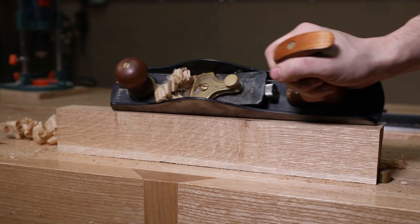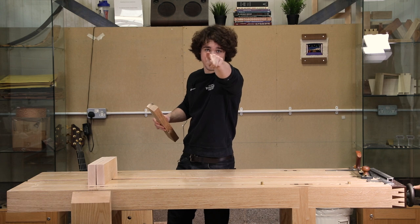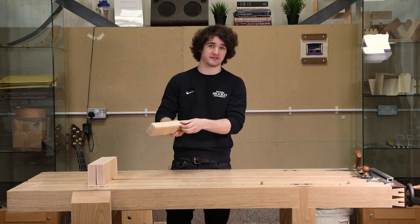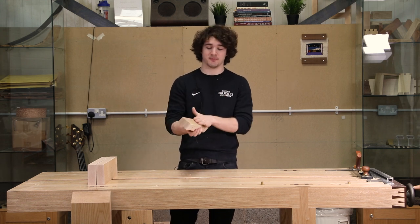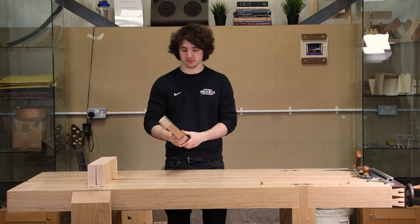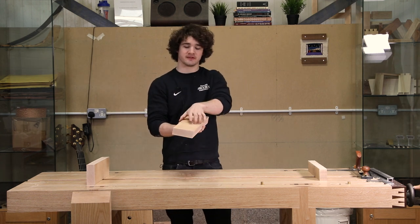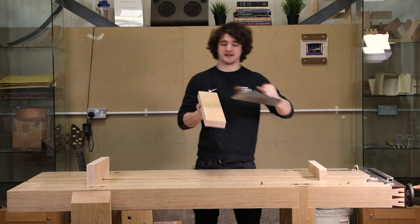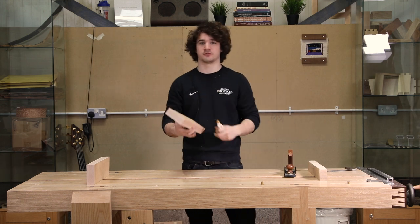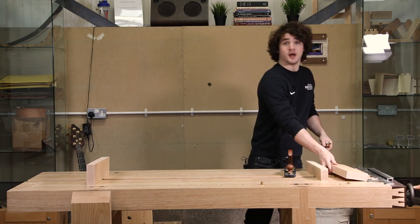After a full-length shaving the straight edge is scraping evenly, meaning it's touching on both corners. Check for square again — the left hand side is a little bit higher, so just do a small shaving there — maybe one more. Right, that's all good. One last check — all scraping along there. And that is how you plane a face side and face edge on a bit of timber. But do not assume that's the same approach for the opposite faces — if you use the same methods on the opposite face or opposite edge, you're going to encounter problems. I'll go over that in the next episode. Same rules apply to the beech: get the twist out, make sure there's no bow, square off one edge, then watch the next video.